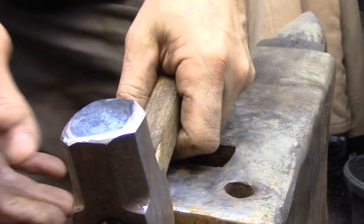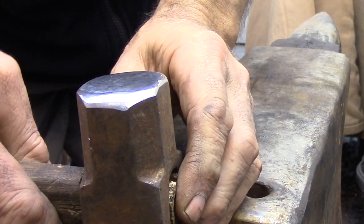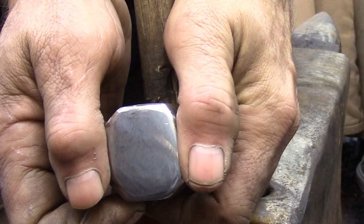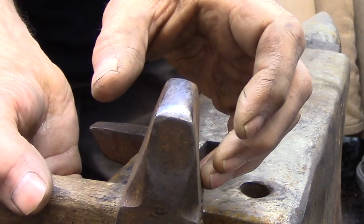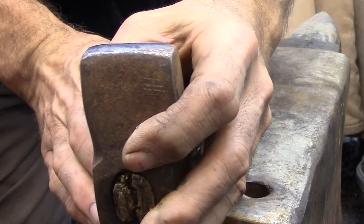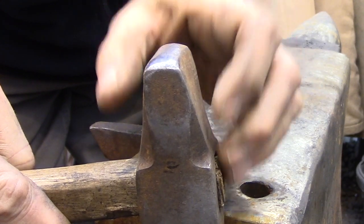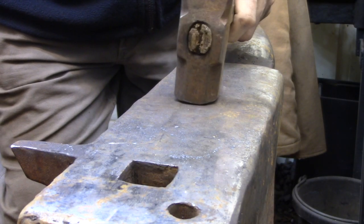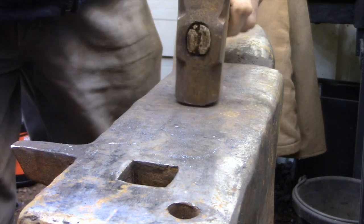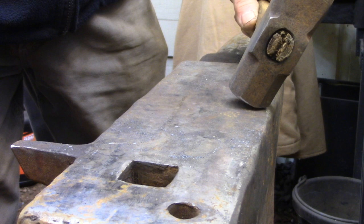Here's the new hammer face ready for forging. You can see how I have a large radius on both sides of the hammer and the front and back edges drop off pretty sharply. That leaves me with a flat rectangular face in the center of the hammer that I use for flattening, and then the edges are used for fullering. Basically what I've done is recreated the cross section of my cross-peen on the front face of the hammer — imagine a cross-peen stretched out sideways. That hammer face also matches the shape that I have on my anvil: a center strip that's flat and edges that are fairly radiused, so as I tip my hammer while drawing out, the radius on my hammer starts to match the radius on my anvil.